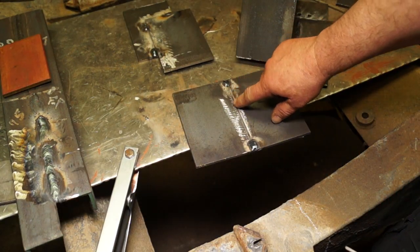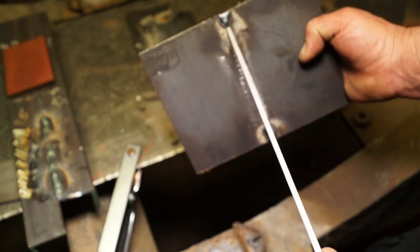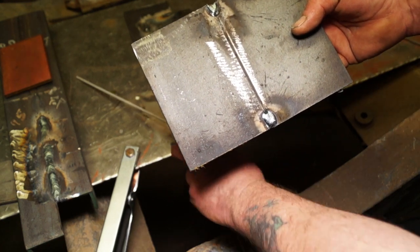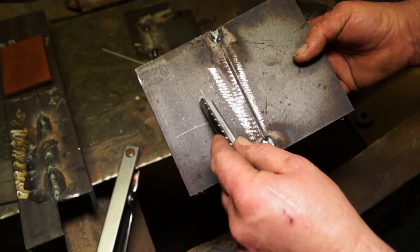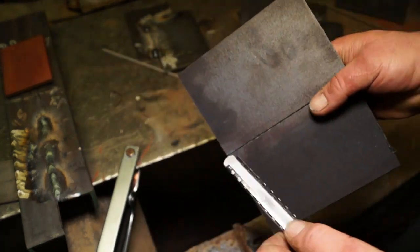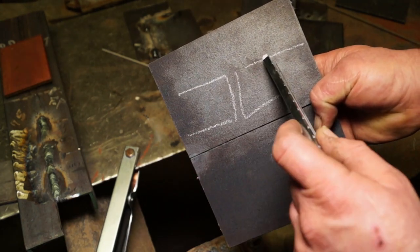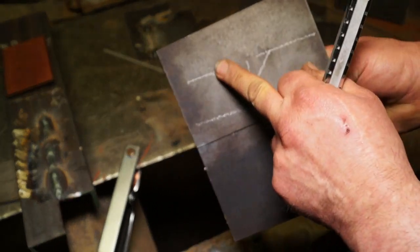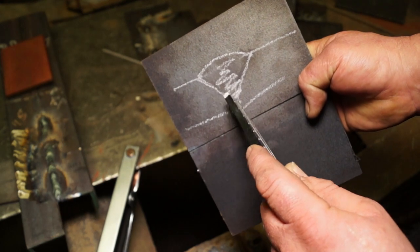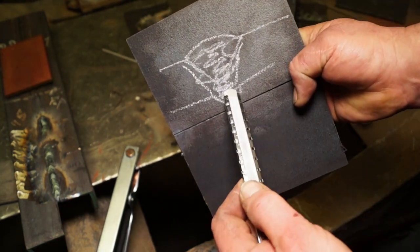I'm going to butt weld it — not patch it — which means joining the steel edge to edge. It is a recognised technique, so it hides the weld, but we need to make sure we can grind the weld off and still have enough penetration. For butt welding, we have two pieces of metal edge to edge and I need to cut off 30 degrees on a portion of each edge, which allows more penetration into the steel. Welding in that area and filling it up will give a joint with the right strength.